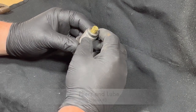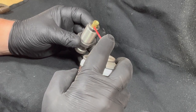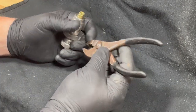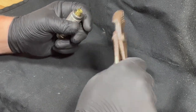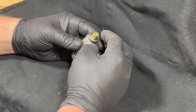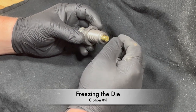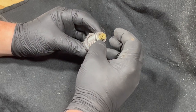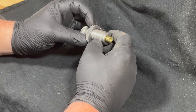You can use some sort of lubrication — spray it into the shell casing, hopefully that loosens it up. Then take a pair of pliers or vice grip and try to break it free from the die. I haven't found much luck doing that, but you can try. I've also heard some people say putting it in the freezer overnight somehow shrinks the shell casing and you're able to bust it out as well.